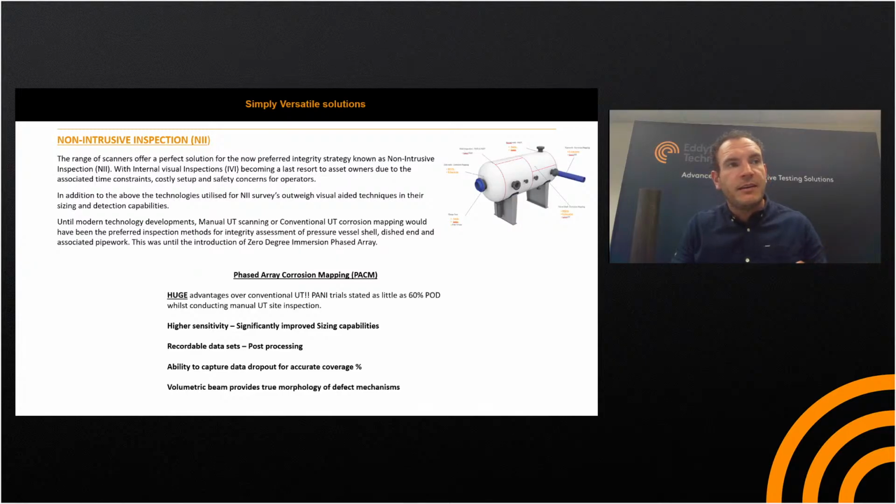Of course, you get diffractive responses with phased array technology, which again backs up the probability of detection, in that it's capable of detecting misorientated defects. With conventional ultrasonic methods, it's sometimes very difficult to detect because you can't differentiate between surface condition and a loss of ultrasonic response due to a misorientated or complex-shaped indication where the sound would be scattered.